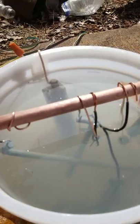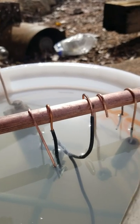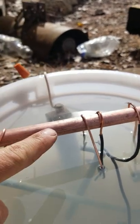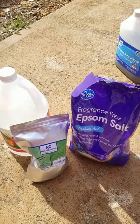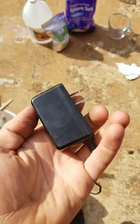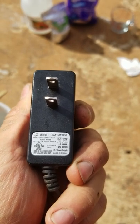That's looking good. I got a bunch of parts in there right now — they've been in there for like an hour. You just hang them on the bar like that to conduct electricity to them. That's the negative, that's the positive. It's not very harsh; you just need a couple of simple chemicals — I'll put links in the description where you can get these on Amazon. You just need a little baby wall wart for power. This one's five volts, 800 milliamps. Don't go too high.